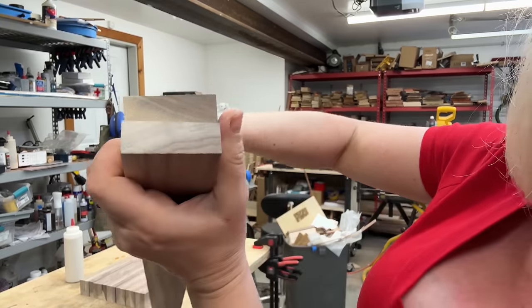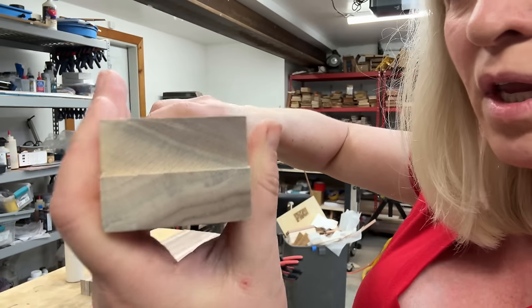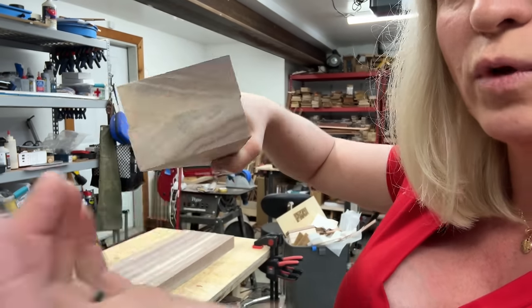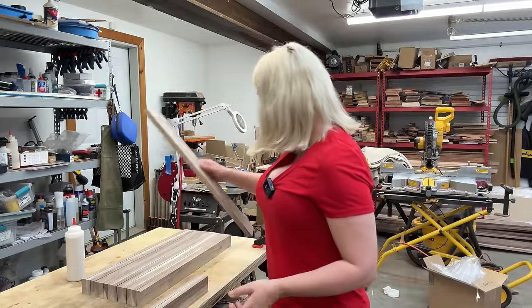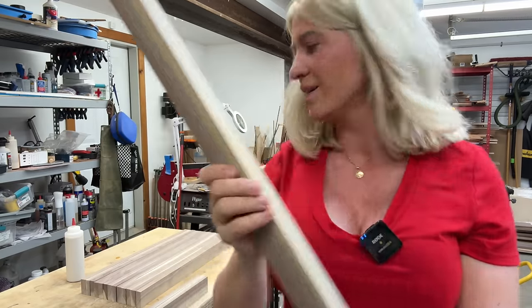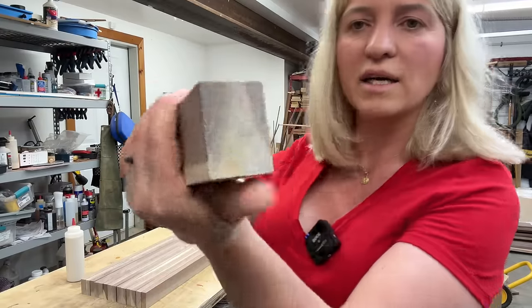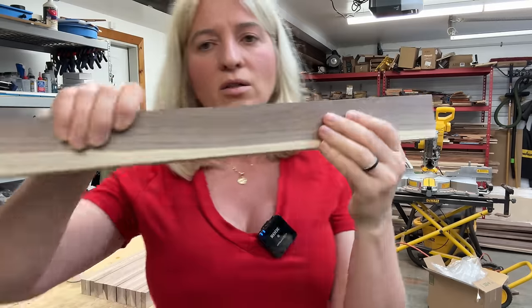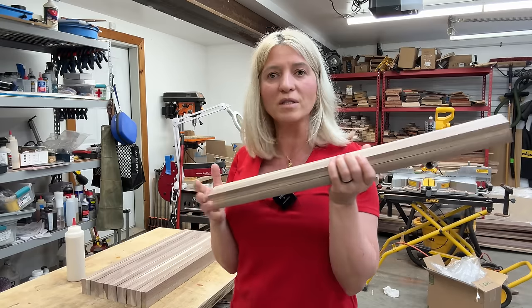After the glue-up, when we cut it and bookmatch it, we should end up with nice diamonds. Sometimes boards have sap that doesn't go all the way to the end, so the design kind of stops — I use those mostly on the outside of the board. I keep the really nice ones, the ones that will make that half diamond, and place them smack in the center of the cutting board so they become the center of attention.